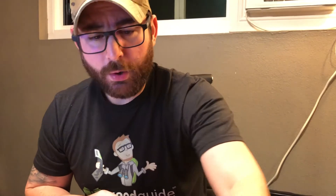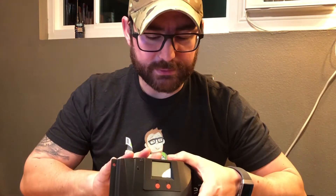That also allows me to put the amp meter in between if I want to, which I do in the demo video. This is a 12-volt or 24-volt solar charge controller with a max of 20 amps. In my test I was actually seeing about 22 volts coming through the system before I had a load attached.